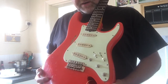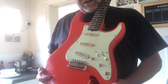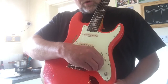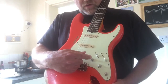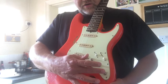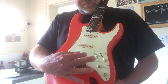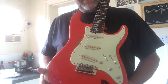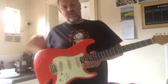I'd done some research online, watched some sound videos on YouTube, and in a direct comparison with CTS, Bourns, I would say, are very close. I chose to go with Bourns. They're very, very smooth. They're quite easy to roll, actually. So when I do put the covers on, I've got standard cream covers to go on, but this is volume, where this would say tone and that would say tone. That one's got a volume of its own, but they're a matching set. So it would be volume, volume, tone. And obviously with my little upgrades on electrics, this is a Gary Moore replica Strat, which I've built.